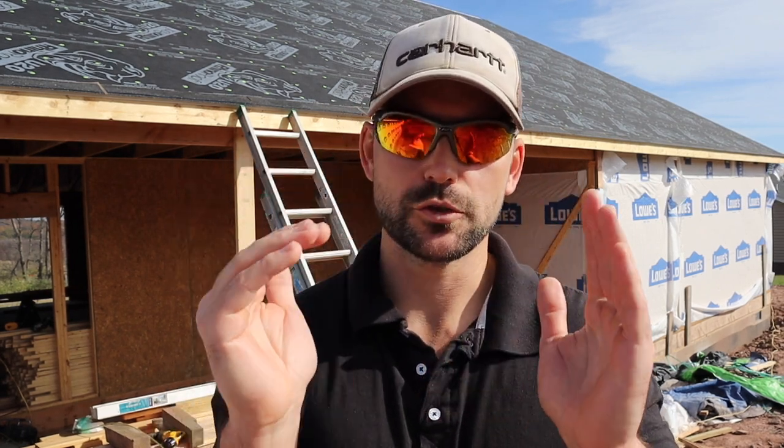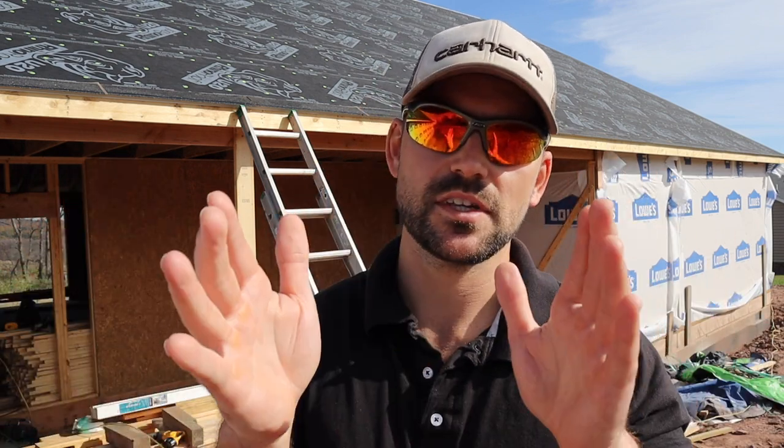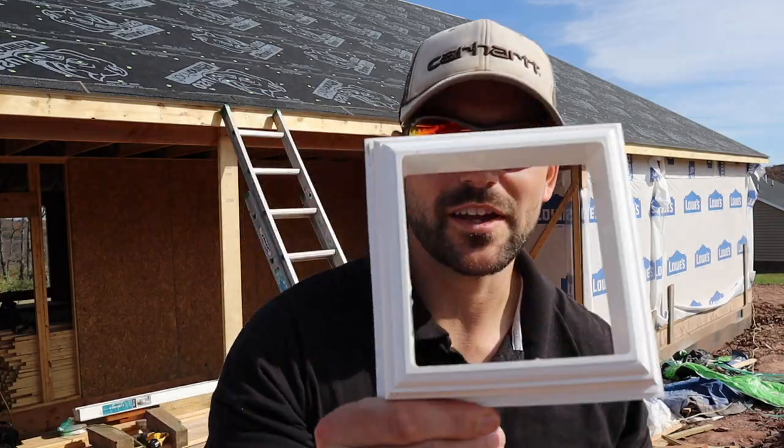The post you're actually going to use to hold up your beam is going to determine the thickness of your beam. I'm going to be using five-inch-wide trim around the post — I'm just putting a post wrapped in PVC — so it's going to give me a five-inch width. Ultimately the beam total is probably going to be five and a half inches wide. Let me show you what I got done so you know what's going on.